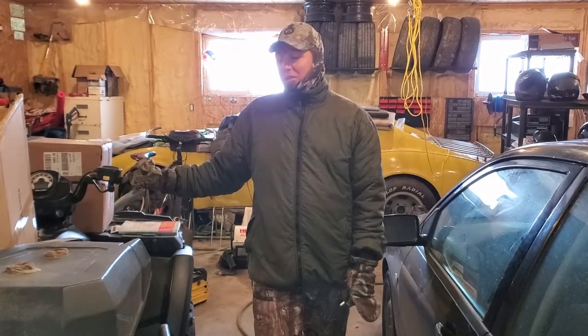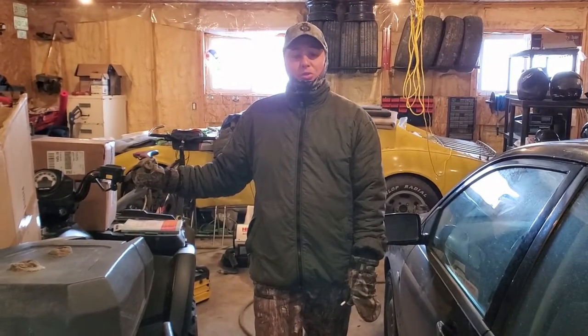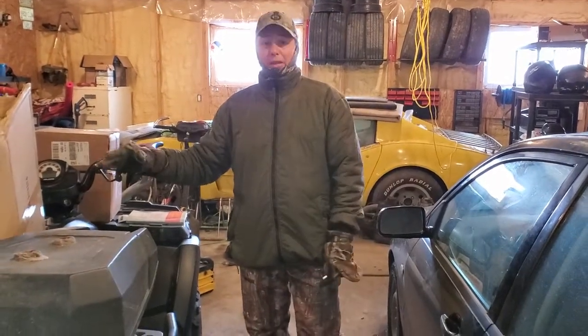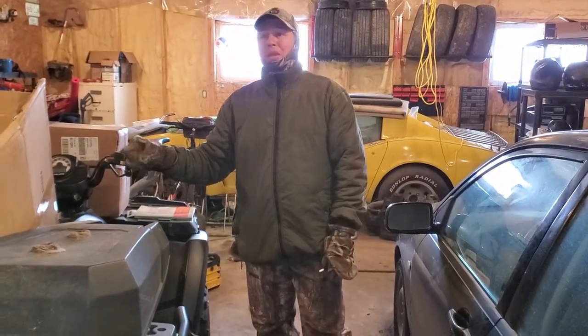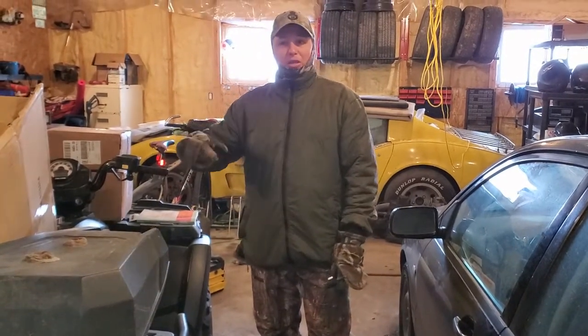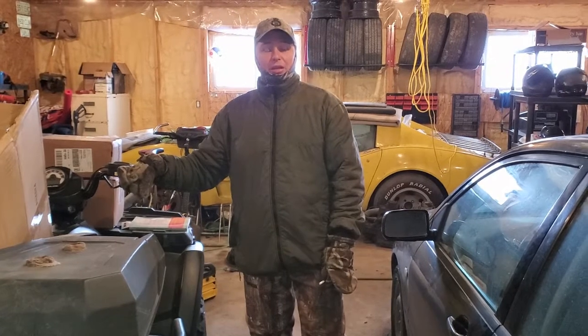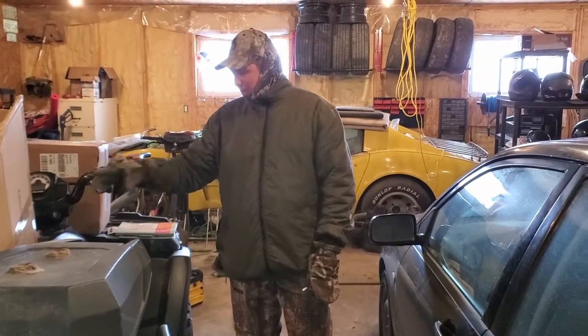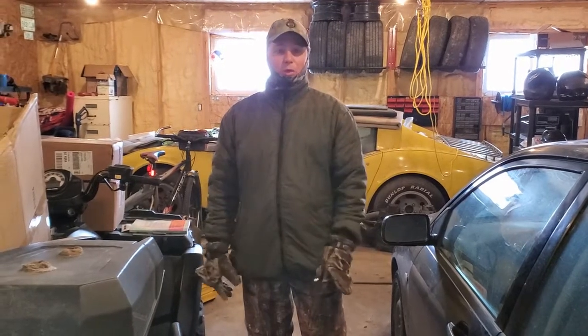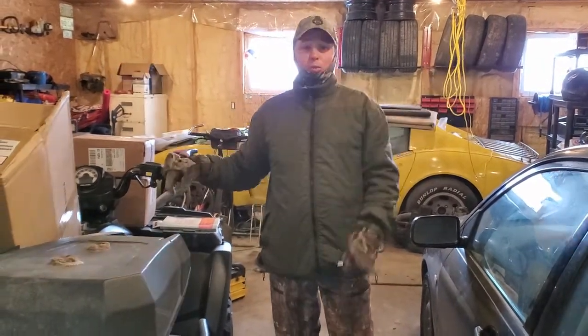Same thing for the summer. Start the quad up, let it run for about those 30 seconds, and then take off. When the belts on these things go, you get no warning. You might hear a little bit. The last time the belt on this guy blew, I heard it slapping around, and about 30 seconds later, it just dynamited. Usually leaves a big mess. I was lucky mine didn't really explode, but a lot of times when the belt snaps, everything will go.